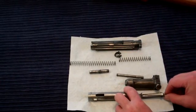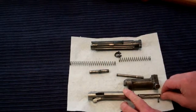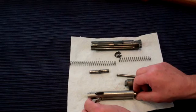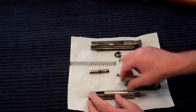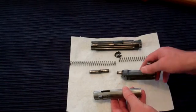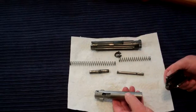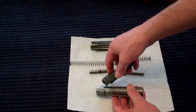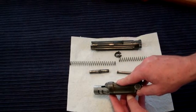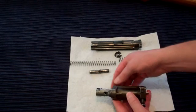Just like I did here — now you insert the firing pin. It's a little bit difficult, but there we go. Now it's together. The next thing is installation of the bolt carrier. The bolt carrier goes through the oblong slot into another oblong slot in the firing pin carrier, so you angle it a little bit and work it in. Once you pull the bolt carrier back, you should see the locking lugs retracting and expanding again.